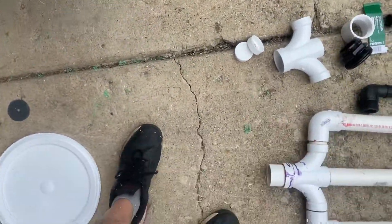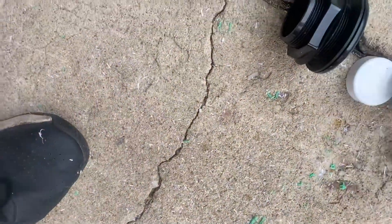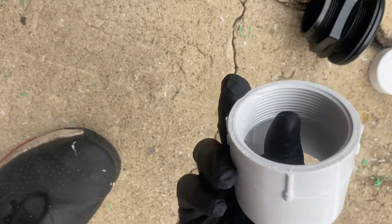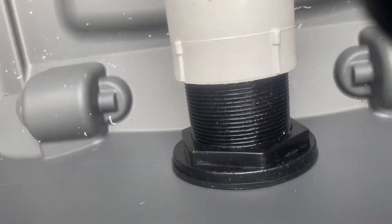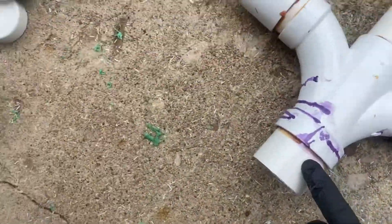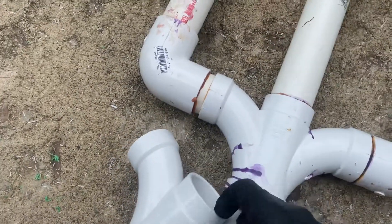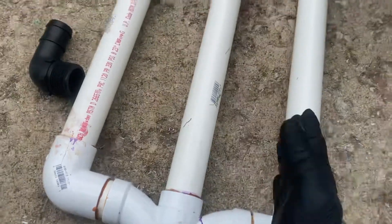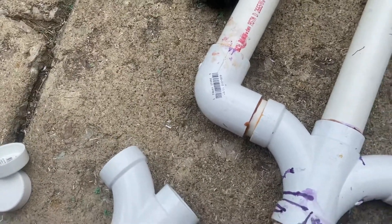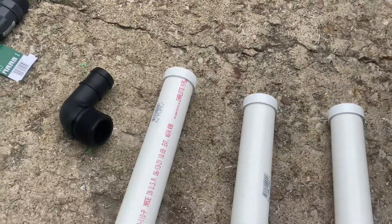The pieces I used are a two-inch inlet. Attached to the bulkhead fitting on the inside is a two-inch piece that's got threaded NPT on one side and takes pipe on the other. Then there's a short nipple piece, a tee that's two inches on the inlet and inch-and-a-half on the outlets. I've got three of them with short nipples, then they make tight 90s. You'll need a little bit of two-inch pipe, the two-by-one-and-a-half tee, some nipples, 90-degree elbows, and inch-and-a-half end caps.